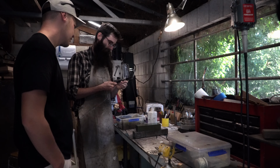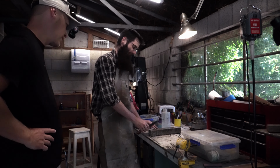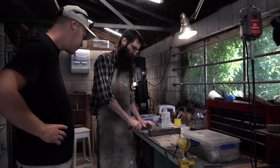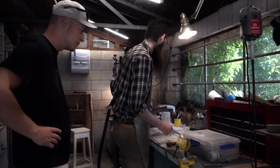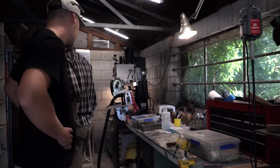Alright. So you think that's got a burr right through? Pretty much, yeah. Once you've made a burr, that's kind of the goal achieved, basically. You can take the burr off by pulling it through wood, and that will take off big bits, really. But you're still left with a fine burr. So to get rid of it, use a strop.